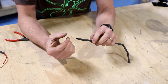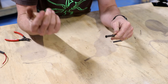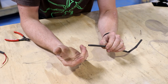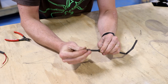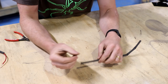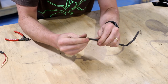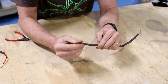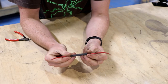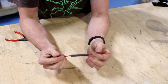It sets nice and hard and that gives your joint a bit more support as well. I've got an automotive and mechanical background, so whenever I'm fixing wiring it's usually because it's broken due to vibration or it's been pulled the wrong way. Solder joints are particularly prone to breaking again from vibration because you have a little rigid section on an otherwise flexible wire, and so it always breaks at the very end. Any support you can give that join with a longer piece of heat shrink is going to make it last a lot longer. Always cut your heat shrink a little bit longer than your join is going to be, to make sure it seals and supports the join better.